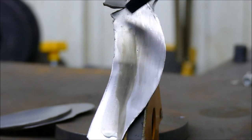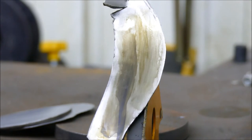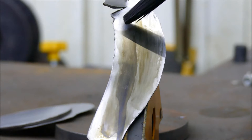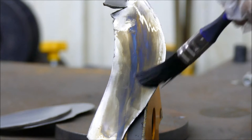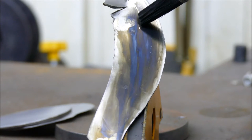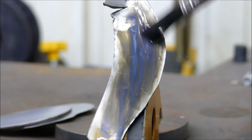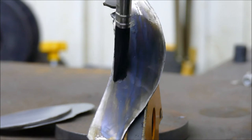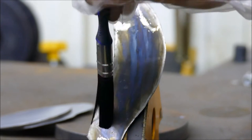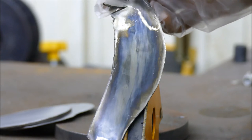Wow, that reaction is a lot faster. So you can see that first drip that I did, it's really kind of stained that, and then it's been a real struggle to get the other parts nice. Now up here, it looks like where I didn't degrease it, so you can see it's resistant. Oh look, you can really see a fingerprint coming out there, look at that. That's where I touched it and didn't degrease it properly. These blues are looking really nice. Oh, look at those blues coming out. So I'm trying to concentrate the brush on areas that are not bluing as fast. Right, I think that's as far as that one will go now.